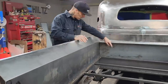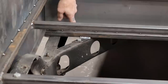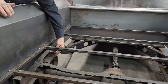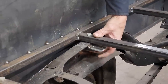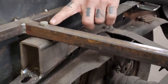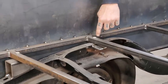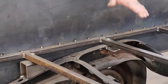I've got one up here, I've welded a piece of plate to the square stock there. We've got a bolt down through the cross member or the X brace in the chassis, so there's one there. I stiffened the frame up a little bit. I welded some 3/16, actually, it was a piece that was cut off of this. It was 2 by 3/16. I welded that underneath there, which made the frame a little thicker, and I bolted it down through there. I might end up cutting that off, adding to it or something. It's not that pretty right at the present moment.